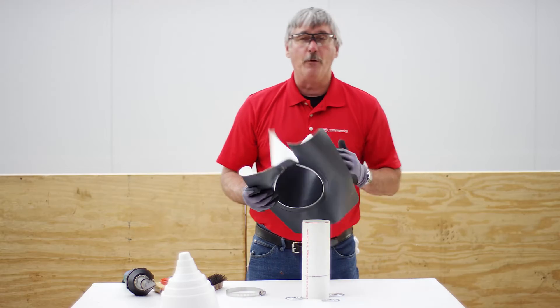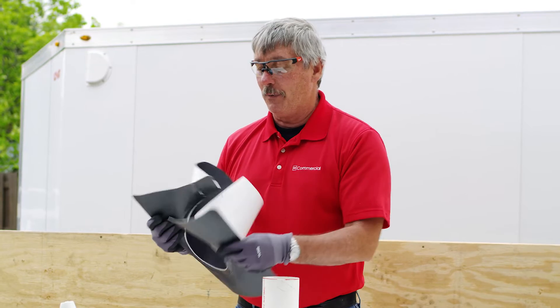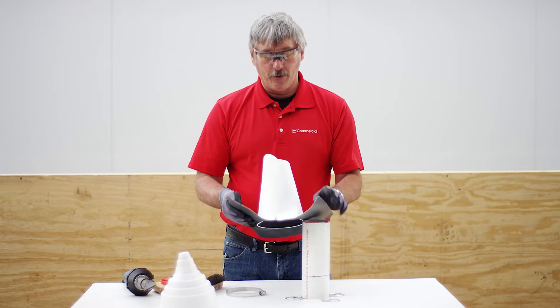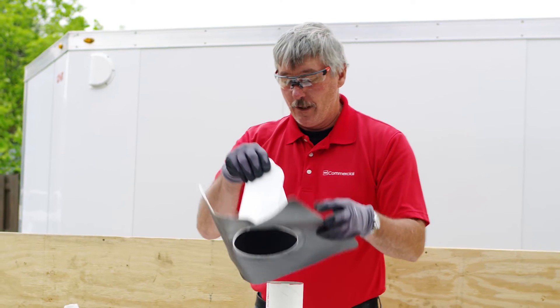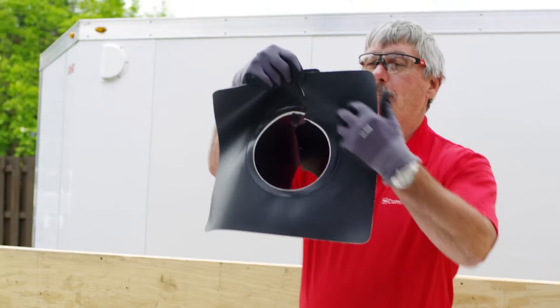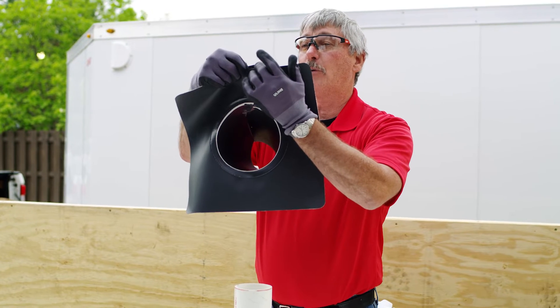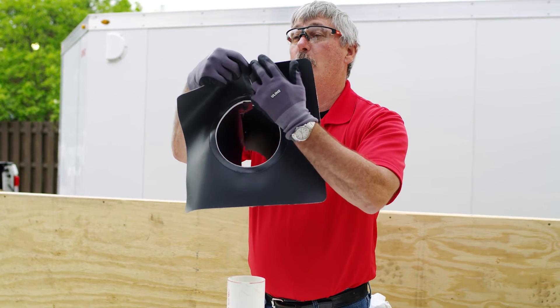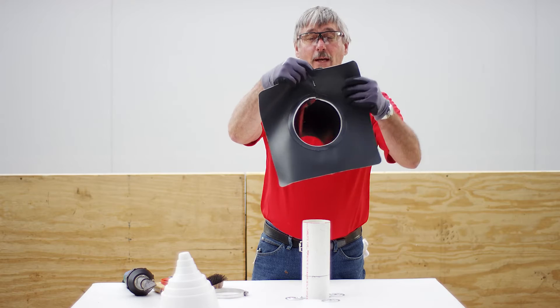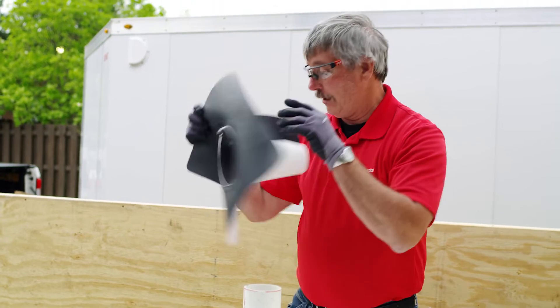Now the important thing to remember: whenever you're doing any type of accessory or detail — be it a curb or a pipe — always dry fit it to see how it's going to look before you attack it to weld it. Sometimes when you dry fit these, what'll happen is this little bit might be hanging over. It's a pretty tough weld, and the inspector who probes this is probably going to come probe it open and make you put a patch on it. So a little trick is, wherever these meet, just dog-ear this back.